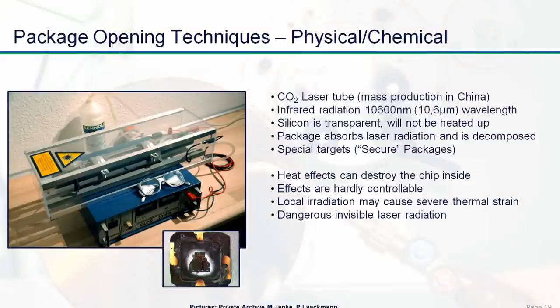You may recognize that the chip is still covered by a glob-top — a small piece of epoxy on top — so the question is how to remove this. Here it's possible to use a laser, specifically an infrared laser at about 10,000 nanometer wavelength. This is quite useful for opening up those kinds of packages because the silicon itself is transparent to such infrared radiation, so the chip will not be directly affected. All the energy will instead be absorbed by the package itself — just a thermal destruction of the package, as visible in the lower picture. This is also quite useful for opening so-called secure packages: even those kinds of packages can be opened with a laser so that the silicon can be directly accessed.